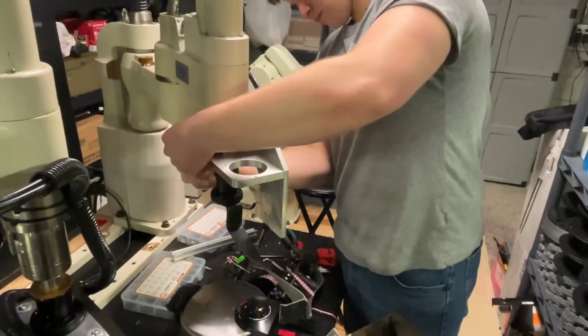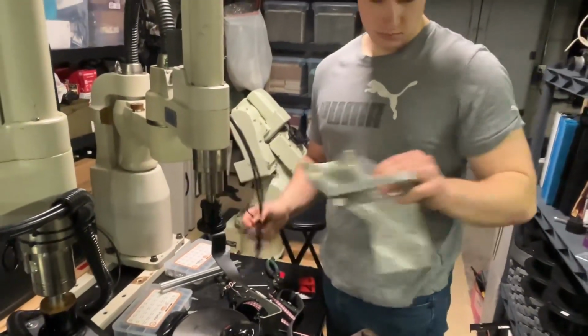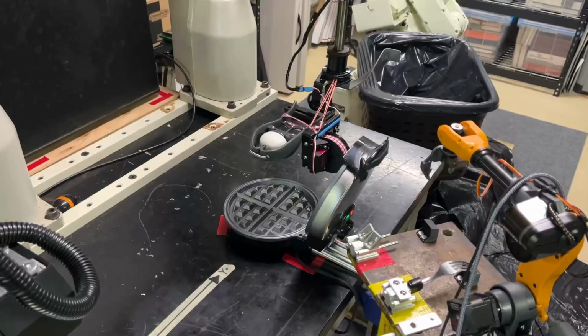In order to gain some rigidity, I got rid of the flipping mechanism and was going to find another way around that. I exchanged the string out for a lot stronger ribbon, got a servo that's a lot stronger and has a lot more travel to squeeze the handle all the way.